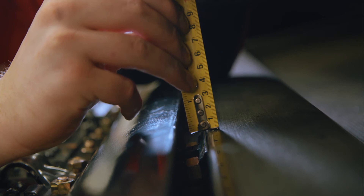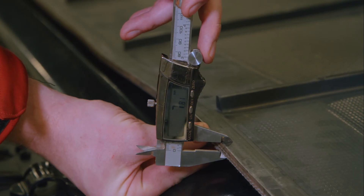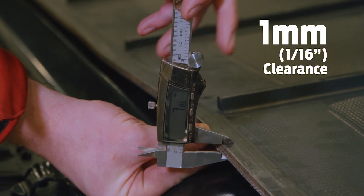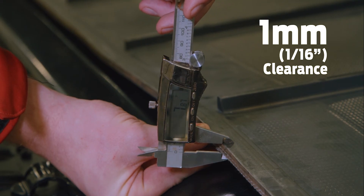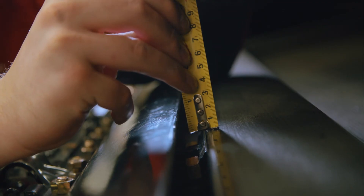To adjust to the specified clearance, measure the distance between the deck and the cutter bar, then minus your measured draper thickness from before. Adjust the deck so there will be a 1 mm or 1/16 of an inch clearance between the draper and cutter bar. Retighten the deck support lock nuts and re-measure the deck to cutter bar clearance to ensure that it has not changed.